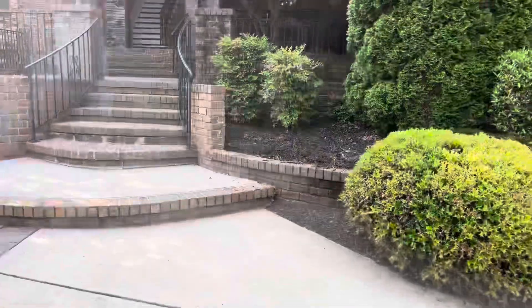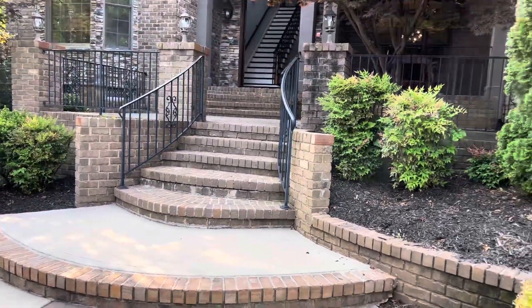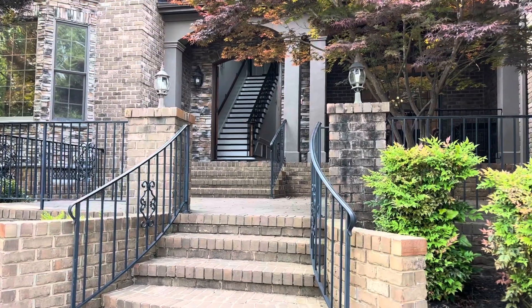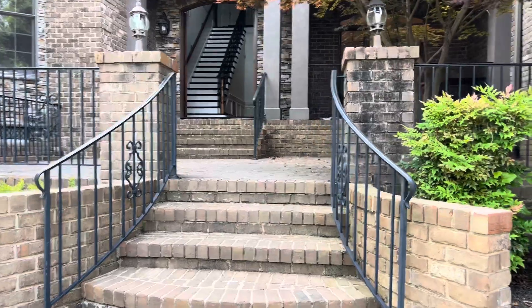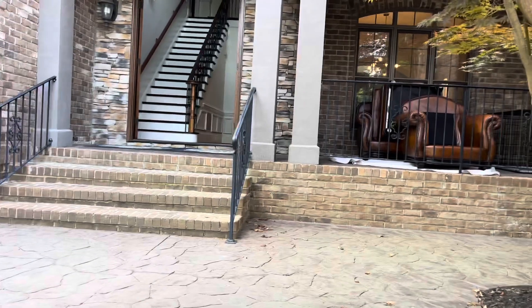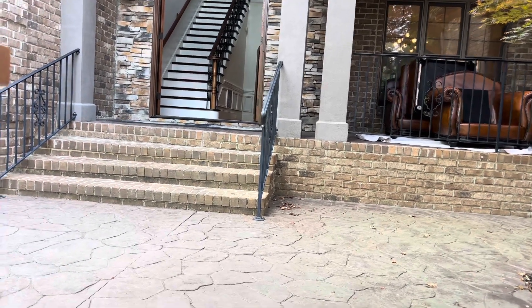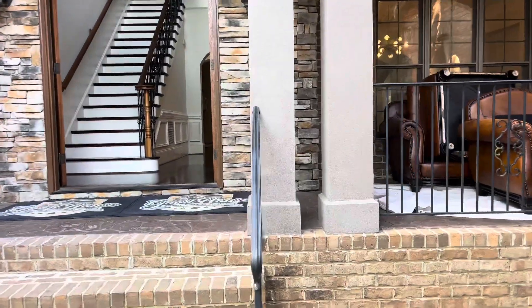I'm here to take care of my new client's hardwood floors. They had solid hardwood floors. They just bought this beautiful home and I guess the previous homeowners, or probably their cleaning company, was putting down some type of wax on the floor and there's a buildup. So we're here today to take care of that. We're going to remove the wax and then go ahead and screen and recoat it and put down two new coats of satin finish, and these floors are going to come out fantastic.